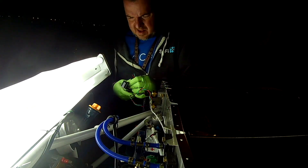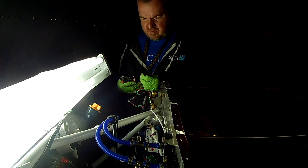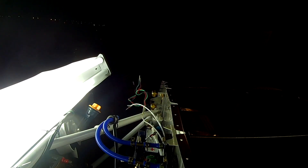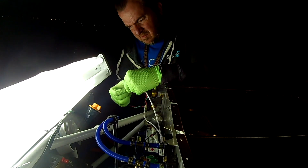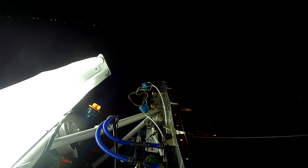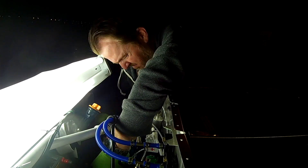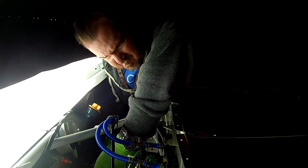We're connecting the sensors with some Molex - three-pin Molex. I like to use the big size ones. The medium size ones are decent, but those small ones - I think it's like point-zero-three inch - the pins are way too delicate and getting them to connect is a pain. The medium ones are okay but the big ones are just so much easier. The problem is they're huge, though I really shouldn't complain considering the weatherpack connectors for the EFI system are also pretty large. But there's plenty of room.